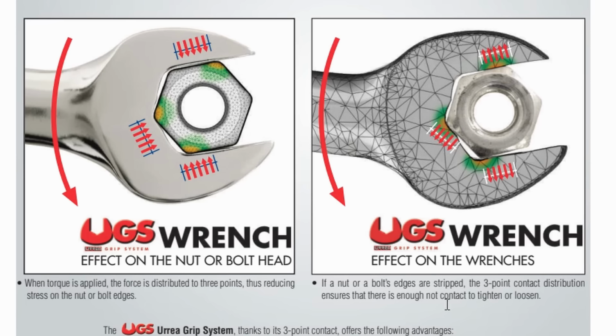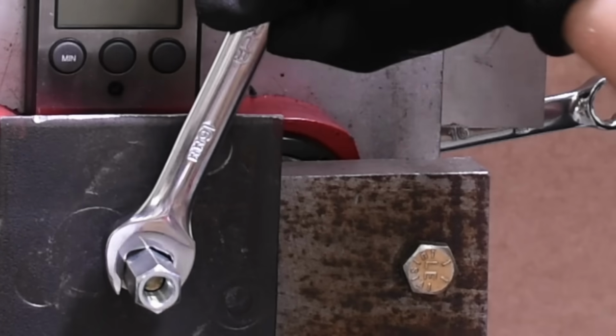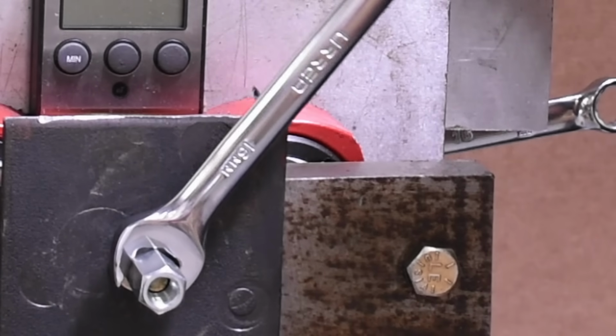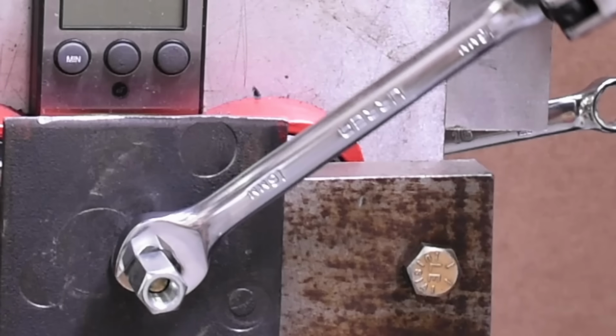This 3D drawing would only really make sense if both the wrench and the nut were fixed bodies. In Fusion 360, they really need to unanchor this wrench so that it can move. This is what happens for us. Check this out sort of frame by frame. The wrench's dimple jaw, once it sees compression, just pushes the nut away. And why wouldn't it? There's nothing on the opposing end to stop it.